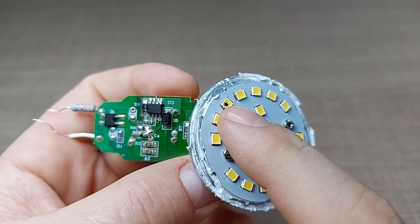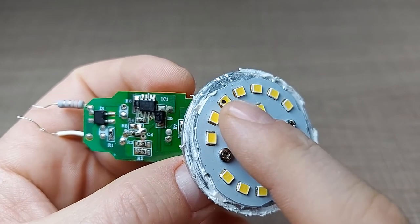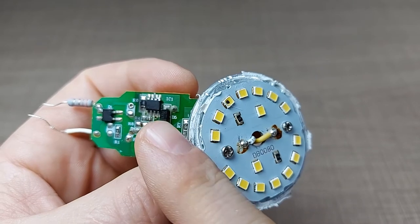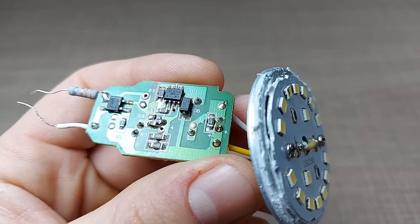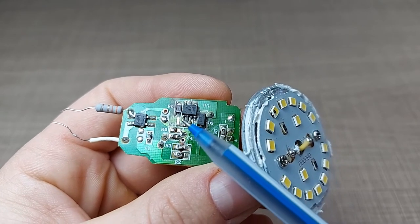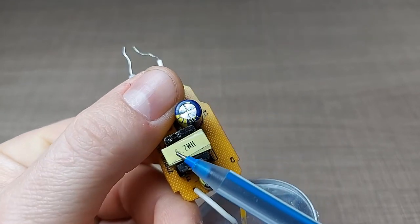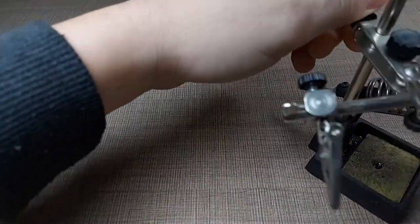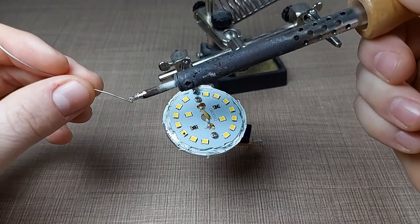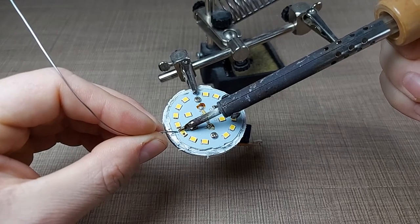Those 100 milliamps theoretically will remain the same even if we try to short-circuit this LED. So that's my plan for today: I will remove this LED and solder a piece of wire across the pads to complete the circuit. Hopefully the chip will detect that change, see the lower voltage, and reduce its switching cycles to still keep the current at 100 milliamps — and that's regulated through the inductor here, which is 5.7 millihenries.